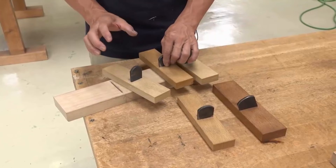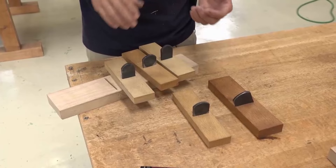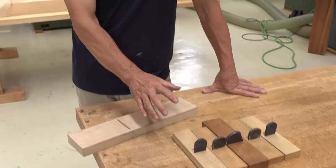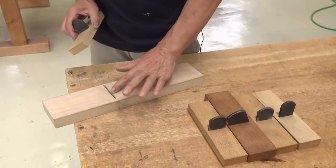I use only a small amount of blade protrusion for the most finely tuned section. For the rest, the blade protrusion can be increased. However, planing across the grain can produce a rough finish, so I use a final scraping plane to take even thinner shavings for the final finish. I have many scraping planes tuned from preliminary planing to the finishing stage, which is uncommon. Most people only have one scraping plane to finish all areas, so the finish can become very rough.